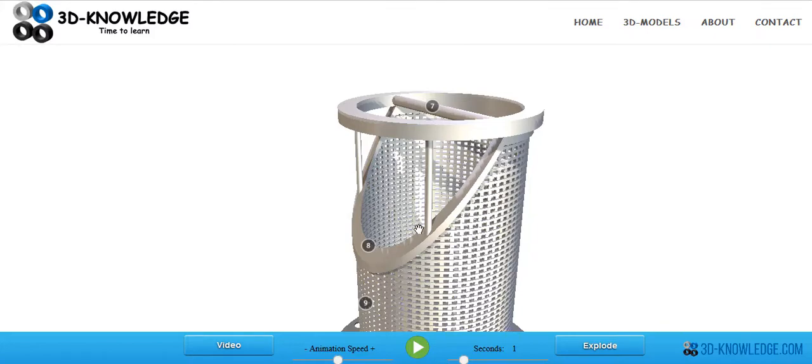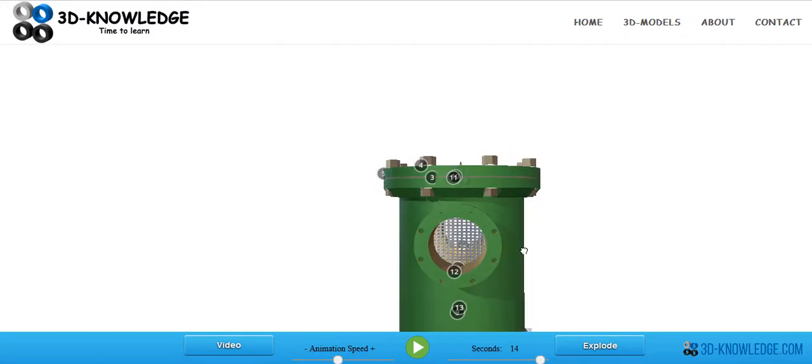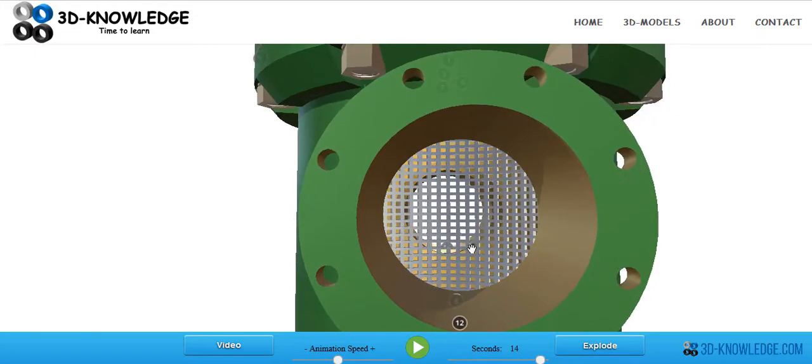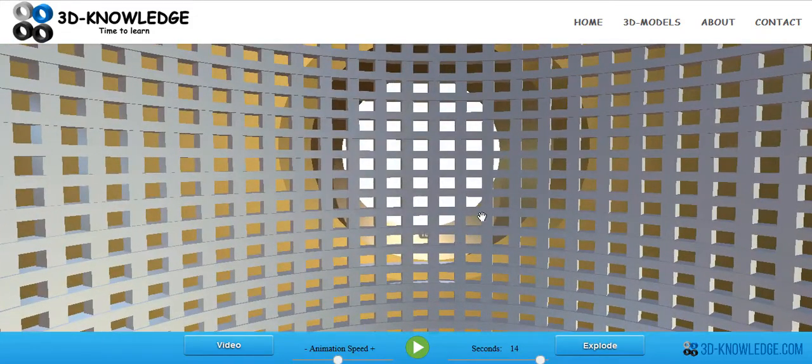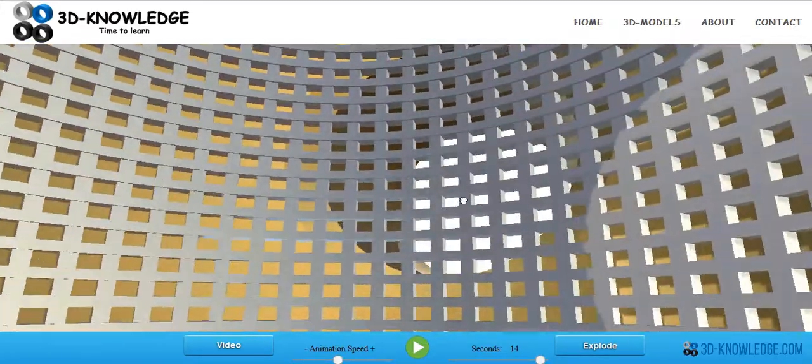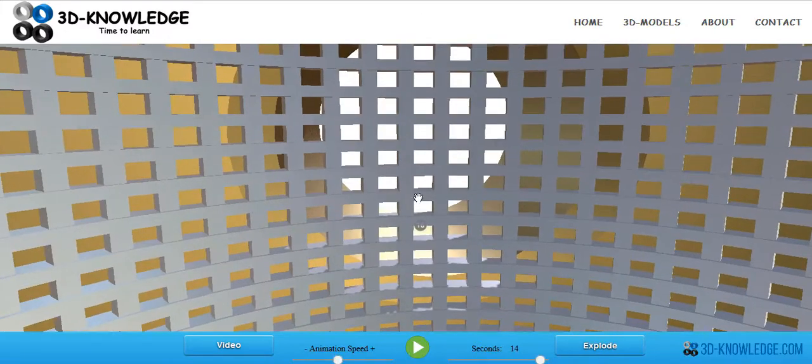You can see from the shape here the fluid will flow in. We'll assemble it first and then talk about what it does and what it doesn't do. Here is the suction side of the filter casing, so fluids will pass in here. Now we are inside the filter casing. What's going to happen is any objects that are in the fluid are going to get stuck — the larger objects are going to get stuck to the strainer.